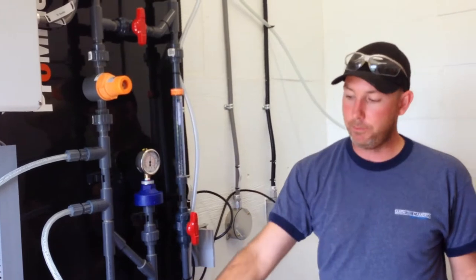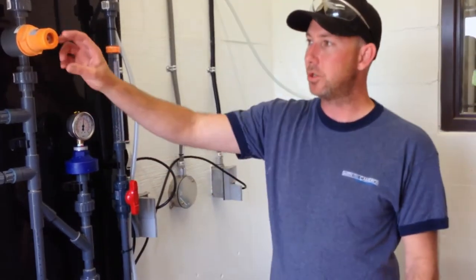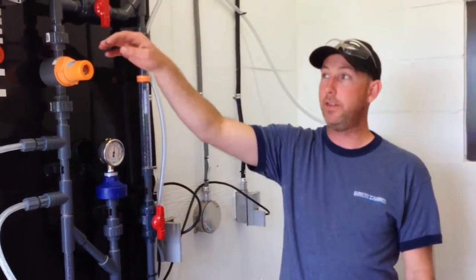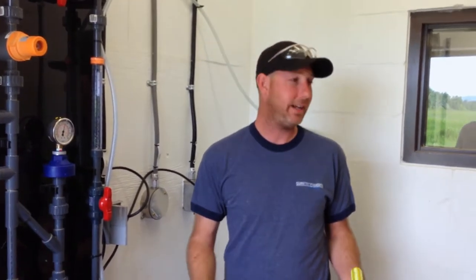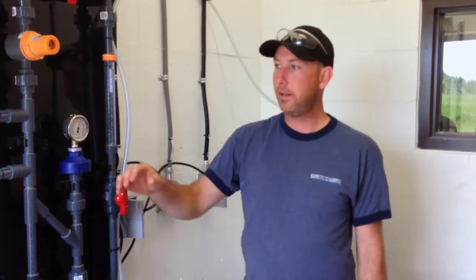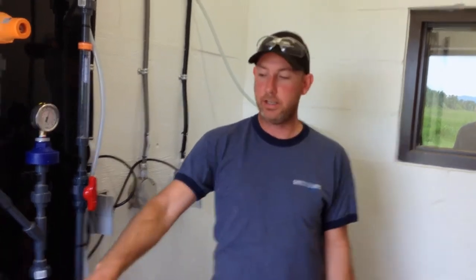So what about metering pumps, do they like that pressure on them? They like pressure, I guess, it makes all those check valves seat better. So, depending on your system, you know, if we had zero pressure on this side, I'd like to see this somewhere up 40 PSI. Because I think your water is at about 100? About 90? We're going to set it slightly more than that. We're going to set it at about maybe like 100, so that the pressure here stays constant. Even if yours fluctuates a little bit, these pumps will always see the same pressure. And that makes them consistent.